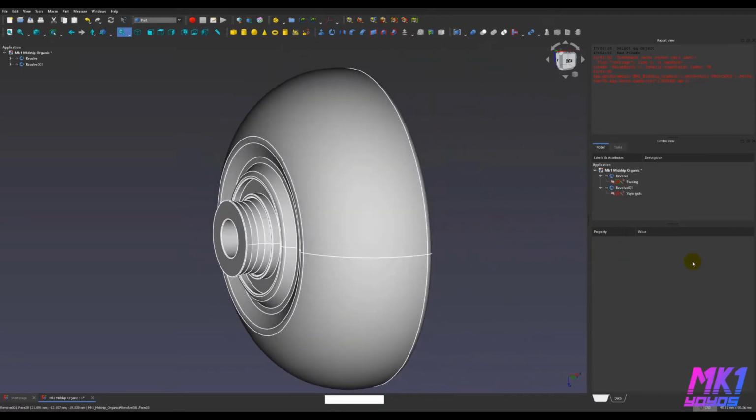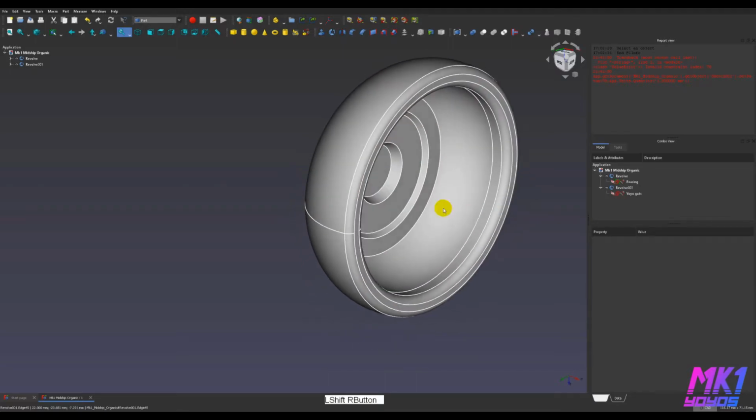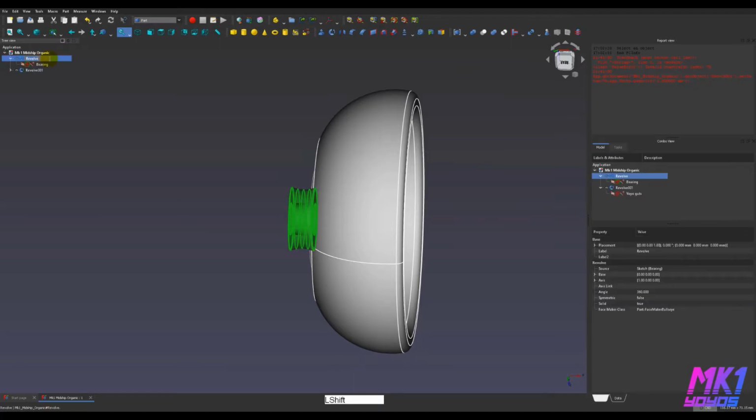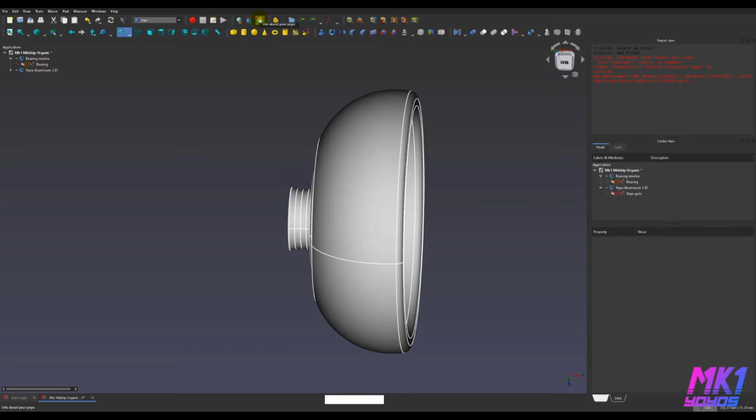So I have some fun macros that let you kind of check the mass and other details of a yo-yo design as you're working on it. So I'm going to rename these. This is the bearing revolve, and this is the yo-yo, aluminum 2.81. This macro will calculate based on densities that are written into the label of the yo-yo itself. There's a link to this macro in the description, and you can follow the usual custom macro installation instructions for FreeCAD if you want to use it.